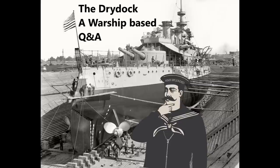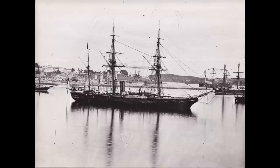Bounty Flamor asks whether there were any advantages of the paddle wheel compared to screw propulsion. There were a few, albeit some came with their own offsets — here you can see HMS Salamander modelling a later model paddle wheel propulsion set. The shaft piercing in the hull where it had to emerge was above the water, as opposed to screw propeller where it must be below the water, so it's slightly less vulnerable to mine shock or hull warping. You also can't have water flooding up a propeller shaft with a paddle wheel vessel because the shaft is above the water.